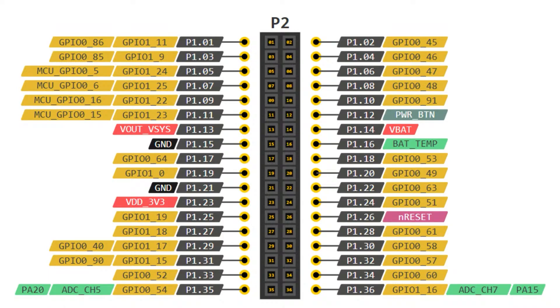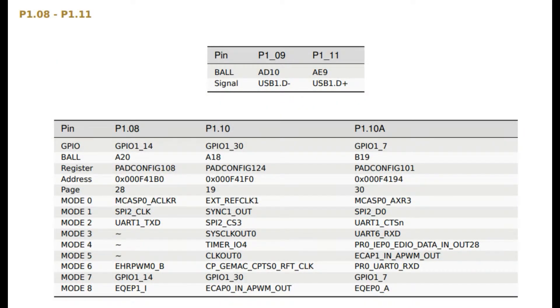This would be like the brains of your design. You plug this in and you have full control over the operating system and have it interact with the hardware. Each of those 72 pins has multiple options available. For example, pins P1-8, 9, 10, and 11 — two of them are USB at the top, but the bottom ones have UARTs, tons of SPIs, like six I2Cs, timers, and PWMs. You can mux them around. You have a lot of flexibility if you want lots of PWMs, lots of I2C inputs, lots of SPI ports, lots of UARTs.